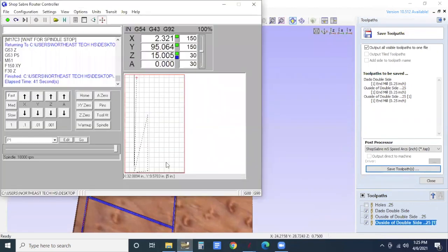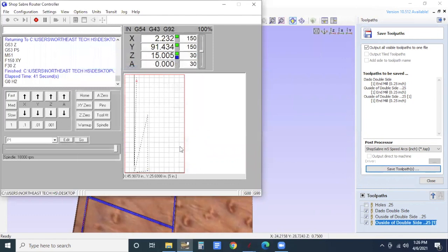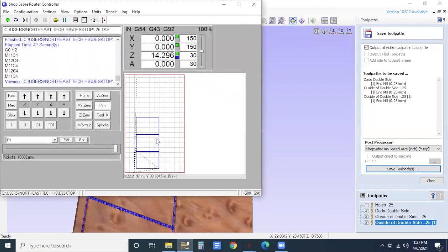Back at the machine interface, I need to adjust the home setting. I'll go to Settings, then Home Position, and select 'pins plus spoil board plus three-quarter scrap' — that's the one I want. I'll click Go To and the machine will move to that location. Home position is set. I'll turn the pins on, make sure everything is lined up, and vacuum it down. Then I'll do File Open, load 0.25, and hit enter to cut the outside.